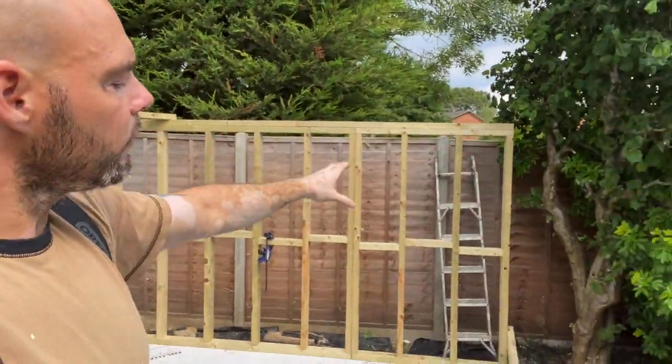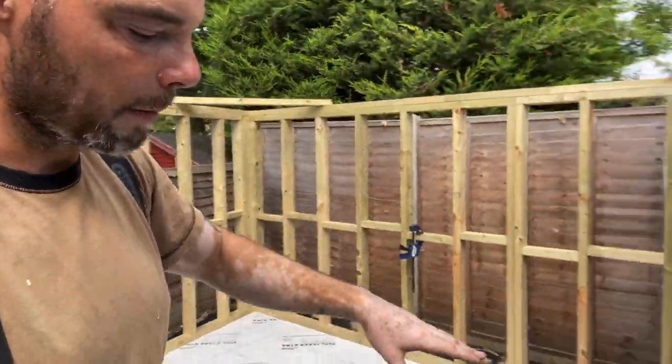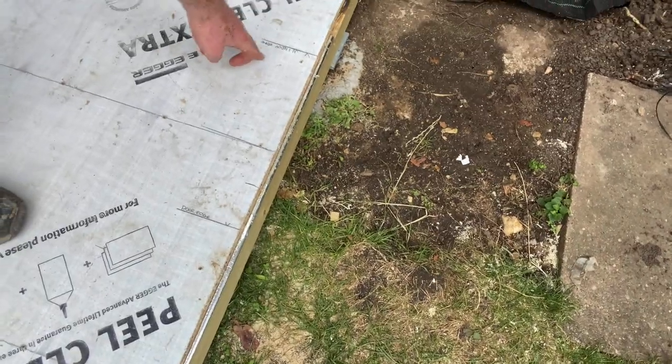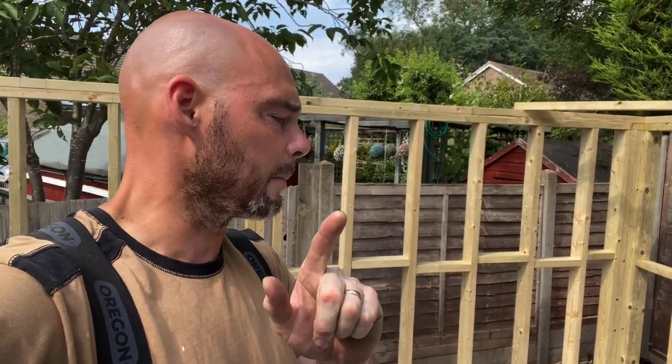So yeah, hopefully get this front wall built tomorrow. That can sometimes take a bit longer than you're thinking because there's a lot of working out. Although to be fair, I've actually done a bit of that preemptive stuff. So I've got the door edge worked out, window edge, taken into account the fact of 10 mil extra for a bit of gap either side, so you can foam fill it and actually get it into the space. I'll explain a bit of that tomorrow.